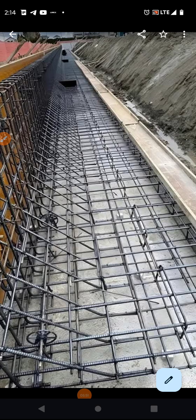And if you look at it, it looks like it's on concrete. I really look for plywood on this. Try to see, is that plywood at the bottom? It still would work against you even more. This is concrete, and so we can't see what's below this concrete. But it should be a keyway. That is, it should key into the soil.